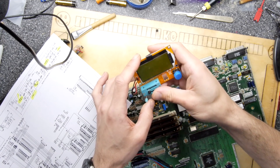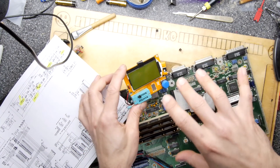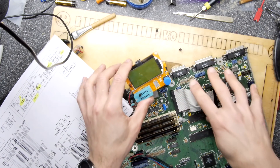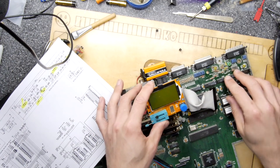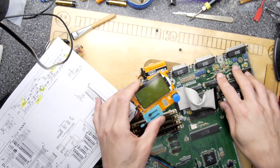I've been spending the last part of my day basically probing this thing and I just don't get what I want to see on the clocks right now. I think maybe something moved in this physical area because the drives weren't bolted down and some of the transistors got bent. Although they didn't look like they were shorting, I figured they're all part of this critical timing circuitry for PAL.